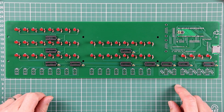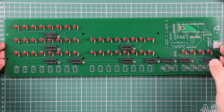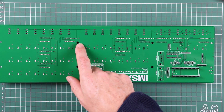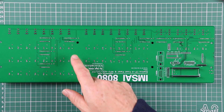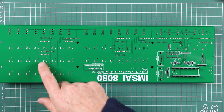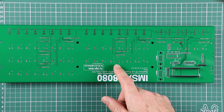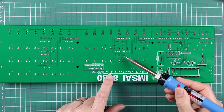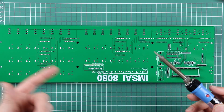That's a lot of soldering and I know, having made a few of these boards up by now, it's very easy to get this far and at times I've forgotten the whole side of one of the IC sockets. So it's really worth going back and doing a good visual inspection of all the work. Check each pin, make sure you've got a decent amount of solder on it. And remember, if you're going to touch anything up, try heat first and just let it reflow before you resort to adding more solder.